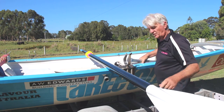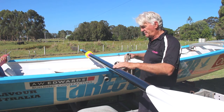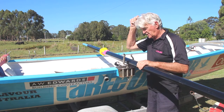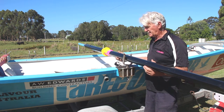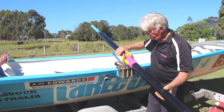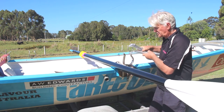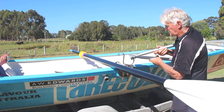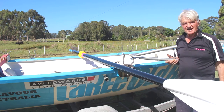Once we've done that and we've got our 10 to 12mm pitch, 100mm in with the plumb bob, we check the gap. That one is far too close — so if this boat rolled, there's a good chance the oar would break; it can't come out. It needs to come out about here. So what we do is bring this in, turn it half, and we need to bend from this point to there. We put the bending tools here like so, and the bending tools up here, and just open that out, one against the other, bending it so we've got that gap.